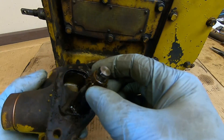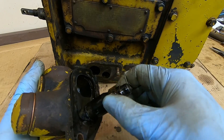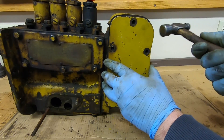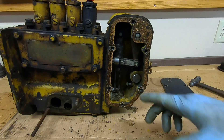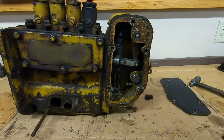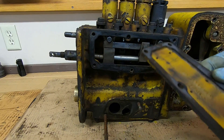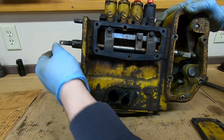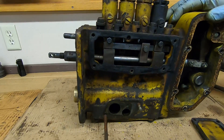With the hour meter off, the drive gear looks good — little bronze gear, pretty much standard on those, and it still turns. Governor cover comes off next. Looking dry in there, but stuff is moving as it should. Pump cover now — not bad for being dirty, also not bad for being rusty in there either. Still curious why that rack doesn't move, but we continue on.